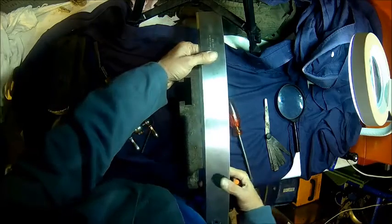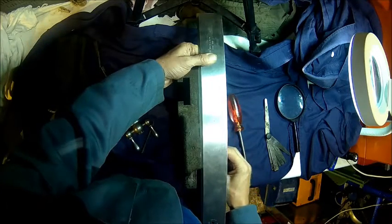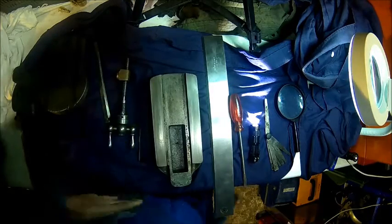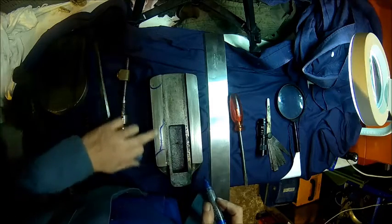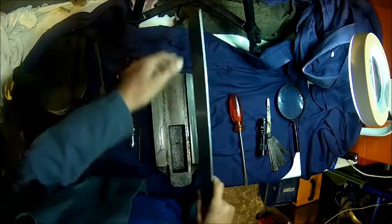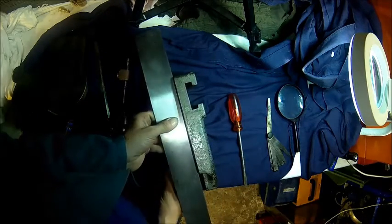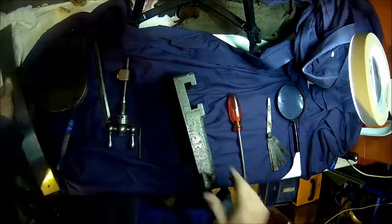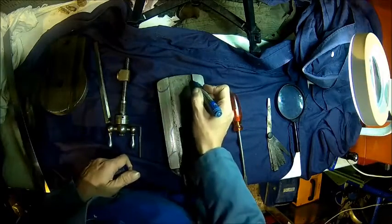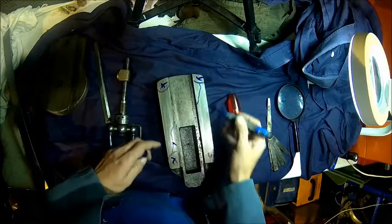And I'm gonna do this way here. Okay. So the top slide on this side, it's high here and probably here, and the rest is down. Let's see the other side. Same story here. Without bluing it, I would say we're high here and lower here. Might be here is okay as well. So this area is low.